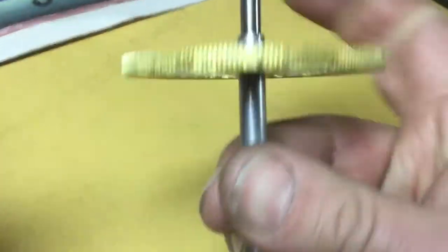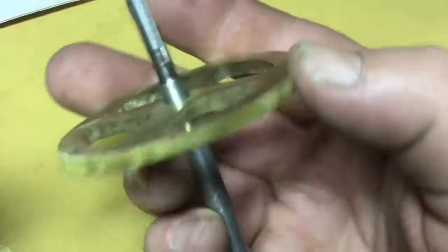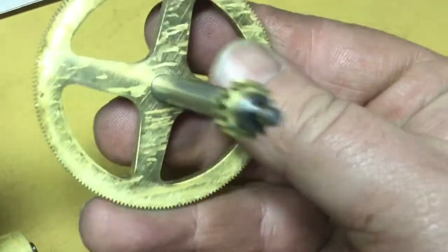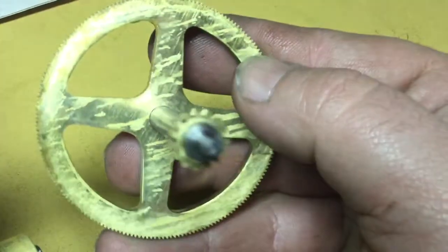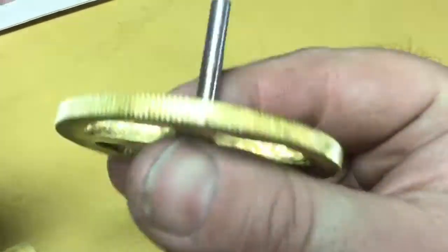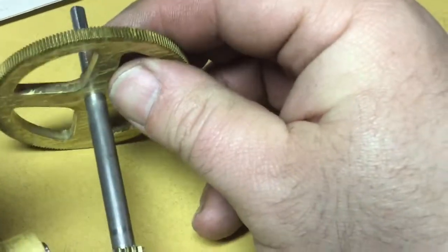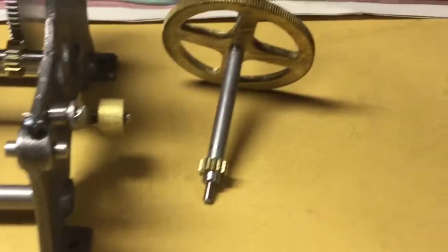The other parts turned out pretty well. The Murphy's Oil Soap brightened the brass up — here's the fourth wheel, you can see it cleaned up very, very nice. I don't know what this streaking is all about — sort of tiger striping — it may have to do with the fact that there was grease and oil on there, which allowed areas for the oil soap to get at and not get at.